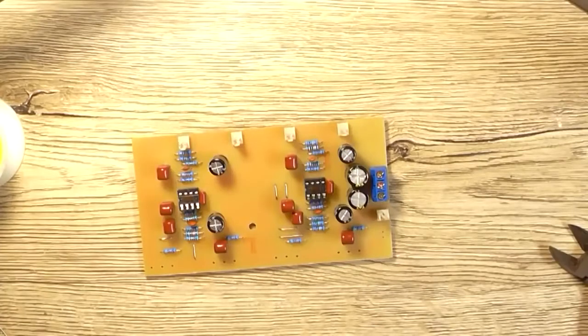Okay, well that's the assembly complete of the board apart from the potentiometers. Now I left them to last because, well, I've got to prep them. I've got to file off the top of the pot just a little so solder will take to it, and I've got to also remove the locator pins on the edge of the pot because they're no longer needed. But for now, I'll install these two